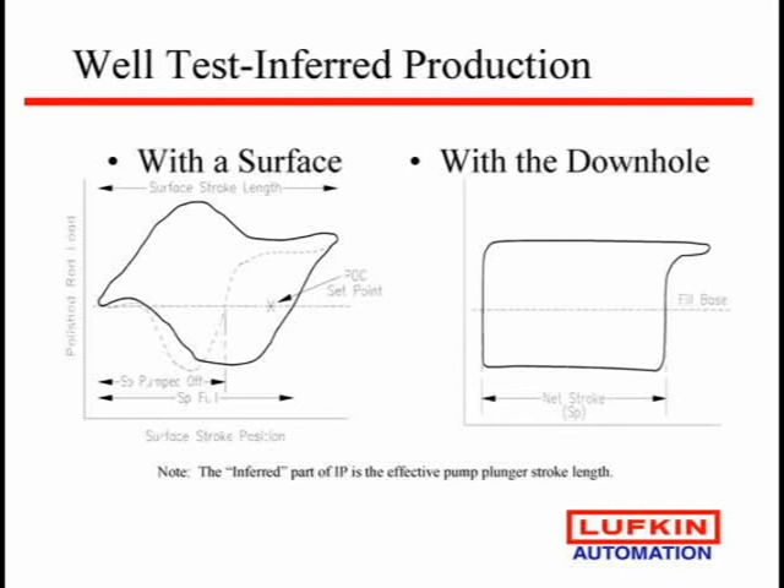On the gas side, we're seeing more and more beam pumps being used for deliquification. A lot of controllers now are actually doing gas calculations — where before you may have had a separate EFM (electronic flow measurement device) doing your gas calculation alongside a rod pump controller, some new controllers can do all that in one box to save you money. And because the gas measurement plumbing isn't always convenient to the back of the pumping unit, you can put a little wireless transmitter on it to bring that data over.